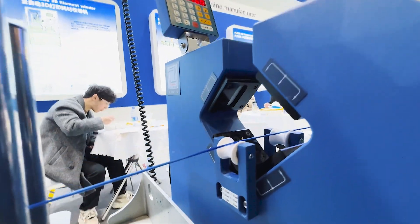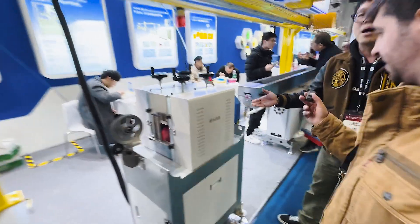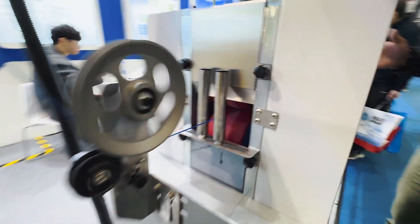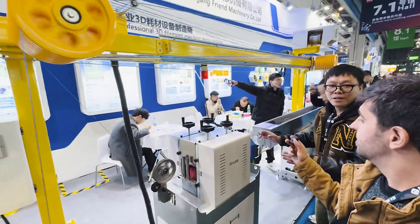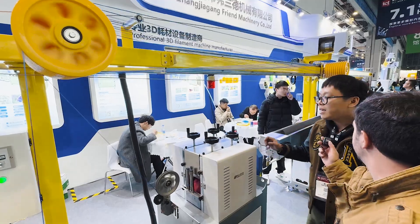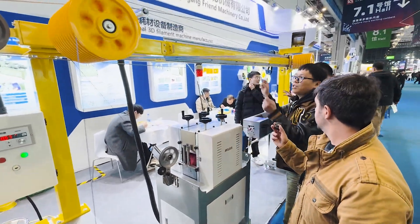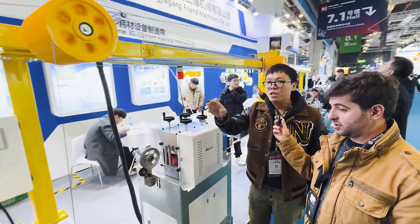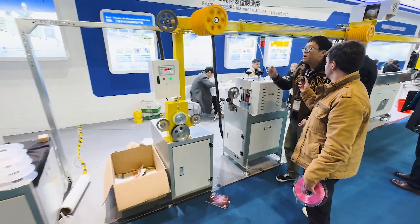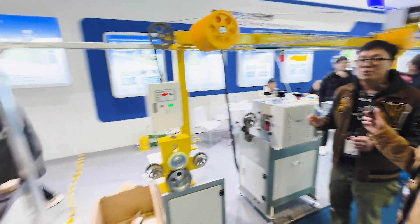The accuracy we can see from the data is below 0.02 mm and it's stable in extrusion. Here comes the puller part — this is a tractor, or haul-off machine. It's made of two rubber rollers controlled by a servo motor. That's how we control the diameter of the filament — how fast we pull determines the diameter. This part is also for storage, because at the end of production when we change the spool, the filament coming out from the extruder will be stored here.